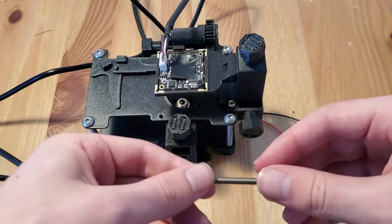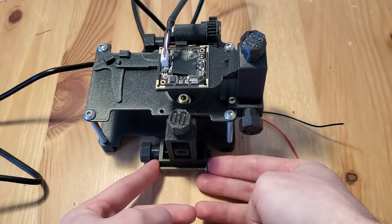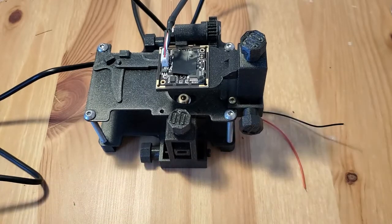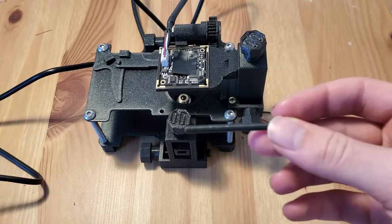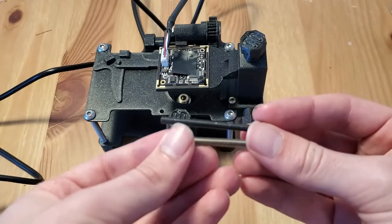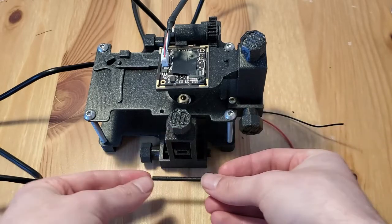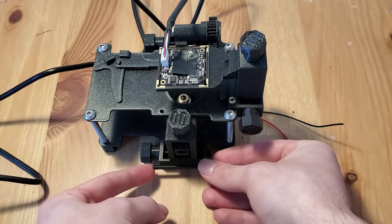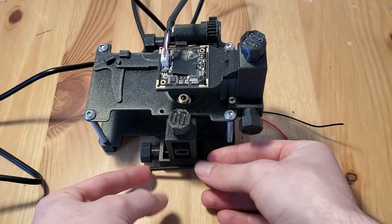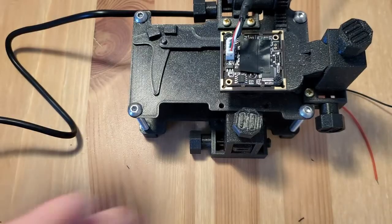That brings me to the first issue I encountered with the assembly of the microscope. The bolt sizes listed in the instructions were not correct for some of the parts. The M3 bolts wouldn't fit the camera mounting holes, and the 40mm M4 bolts weren't long enough for the camera and laser manipulators. In the end, I actually designed my own custom 3D printed bolts with correct dimensions. For the camera mounting bolts, that worked out to an M2.4. For the manipulators, that was a 45mm M4 bolt.